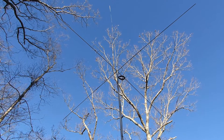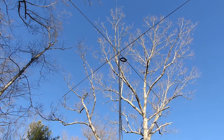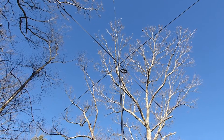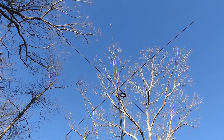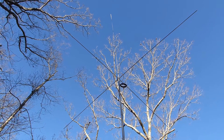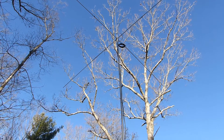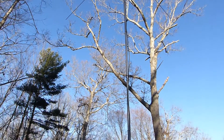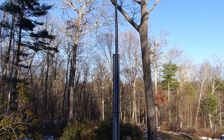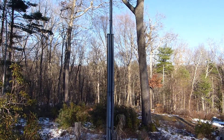The next antenna is also up here on the hill next to my house — some of you have seen this in a previous video where I repaired this homemade tilt-over mast. This is a Mako V58CB antenna and I pretty much use this primarily on 10 meters, but I do use it on 20 meters sometimes — it tunes up just fine and works a little better than the horizontal antenna sometimes on 20. You can see it's mounted to a homemade tilt-over mast made out of electrical conduit and chain-link fence top rail. It's not the strongest thing in the world, but it was pretty cheap to make.